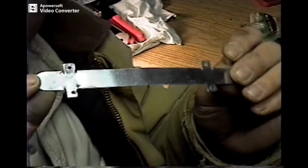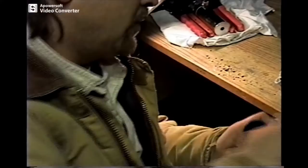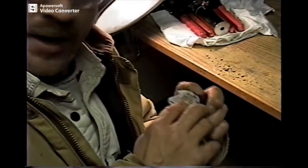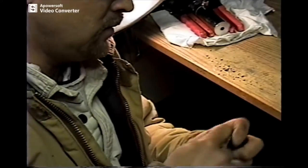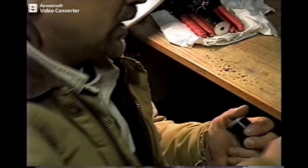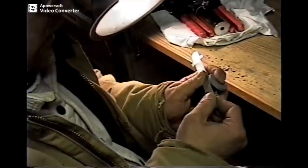There you go. Now I'm going to get my film canister out. We're going to stuff a rag inside the film canister, and we're going to make our circle that way with this piece of tin, sheet metal, whatever you call it. All right, get out your film canister. Get an old rag. Stuff it inside the film canister. If you don't do this, the film canister will be too flimsy, and you won't make your perfect circle that you need on the ears.